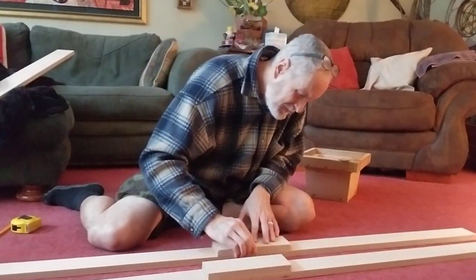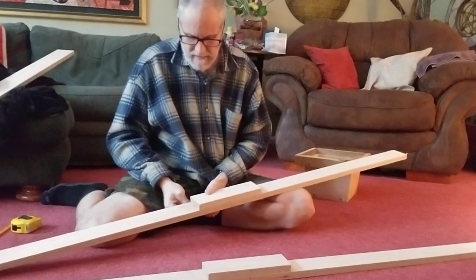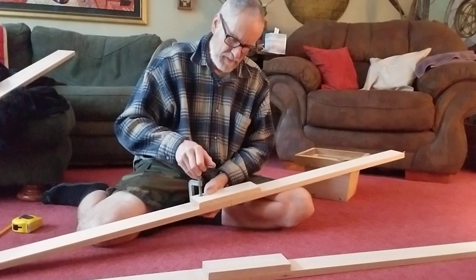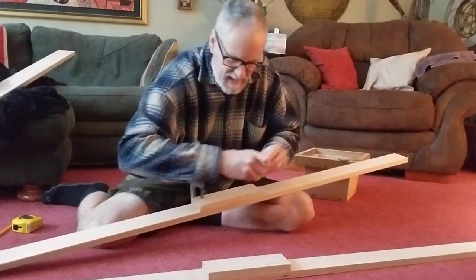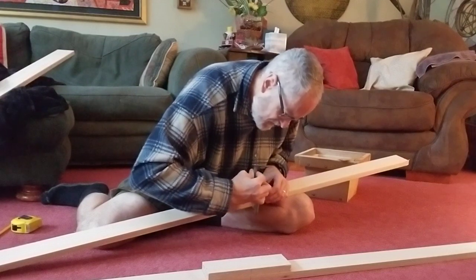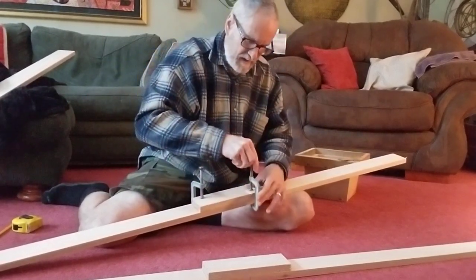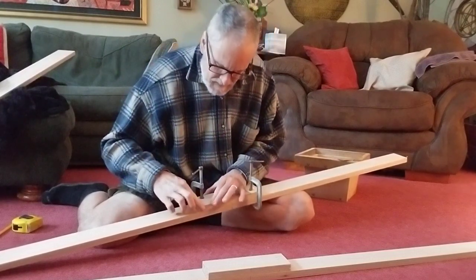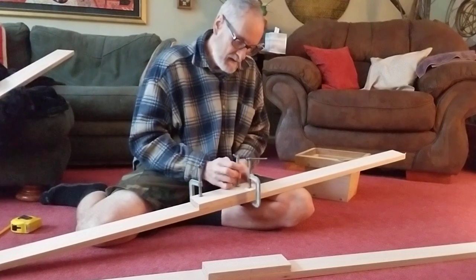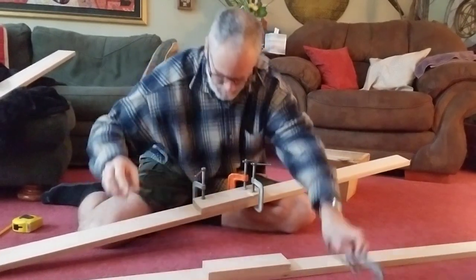Stick it there carefully — I haven't had my second cup of coffee yet. Then it's a matter of clamping. It'll slide around a little bit. I don't put a pad on the riser because that's all going to be gone anyway. I'll do a little crisscross pattern. It doesn't matter the order, just tighten them a little bit at a time, wiggle things around so it doesn't slide off. Take the magical orange clamp — I just happen to have an orange clamp. Four clamps total.